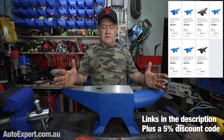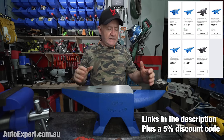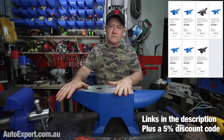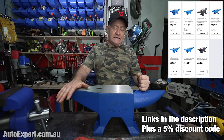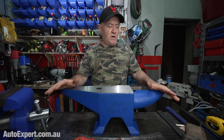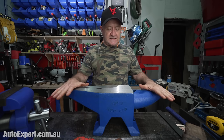But I'm assuming that all of these anvils are scale models of each other, and therefore the comments I'm going to make about this one and why I'd prefer to go with this one as opposed to a very used anvil that's quite old for significantly more money. The first thing you've got to understand about a good anvil is that it's not made of cast iron. It's made of steel. It's typically cast steel.